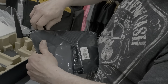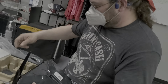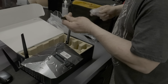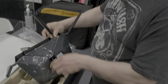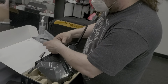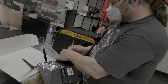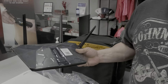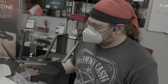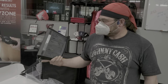I'm trying this as a last-ditch effort to make a door controller work. We have a Comcast business-class router currently running this network, and for some reason we're having communication problems. I tested the cable with a $25,000 Fluke network cable certifier — it passed with flying colors. I replaced the patch cables on both ends with certified Cat 6 brand-new patch cables and still have the same problem. So now I'm going to put the Comcast business-class gateway into bridge mode and use this router instead to see if we can resolve the communication issue. Everything else works — just not the door controller, which is the most important part.